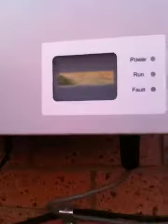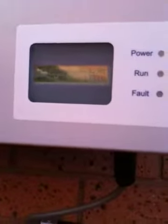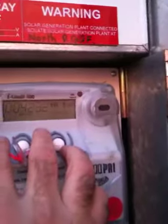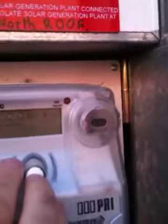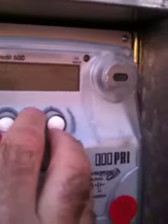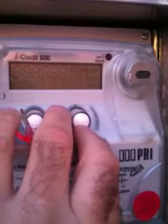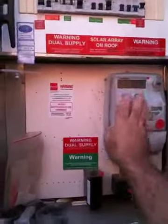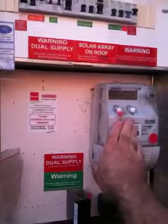What I do is I see what this system's made — like today it made 7 point something. Then in the morning I look at my meter to tell me how much I've got. Like tomorrow it'll be 429.5 or 430 sold back. This will tell me I've made 4.8 today because it's a bit cloudy, it's a bit cold. That'll tell me 4.8 and then this will go up to like 440 kilowatts. So my homemade system makes say 5 kilowatts and the Origin system makes 5 kilowatts — that's how I know if my homemade system's working. I can tell just by the meter here because the meter will tell me how much I'm making on the two. So that's one way of working out if your homemade system's actually chugging along nicely, and they do work together.